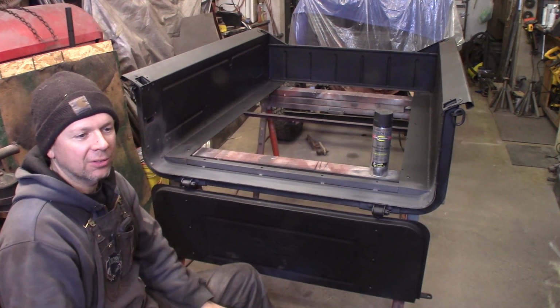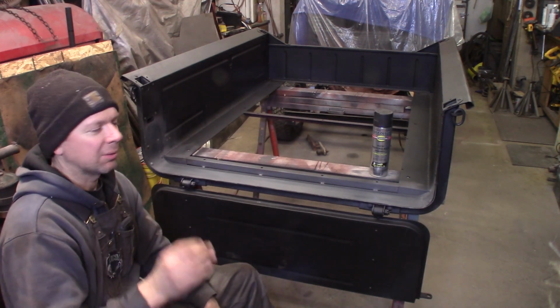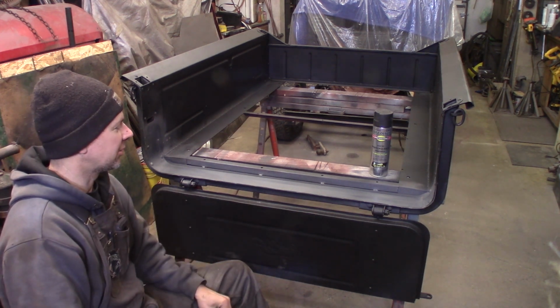I like to do that in all my old cars. I line the inside of the fenders, and where they bolt onto the body, I always paint them with Herculiner because it makes a nice rubber coating for anti-friction, anti-rub, anti-rattle, and anti-moisture and all that.